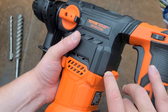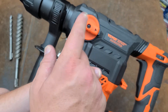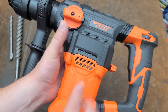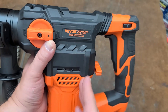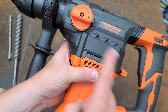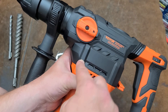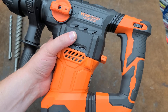You can kind of know the newer ones by this switch here. From an engineering standpoint, it's cheaper for them to have a separate hammer disconnect and rotation disconnect than to put one wheel that works both clutches. The way these work is they have a motor up the middle with a gear — that's why the centerline of the crankshaft is not in the centerline of the motor. There's a reduction gear that runs the hammering crankshaft, and then a second bevel gear that connects to the collar giving you the rotation. The motor is actually spinning two gears at once.